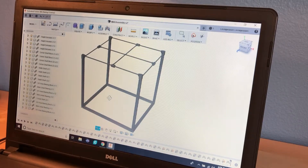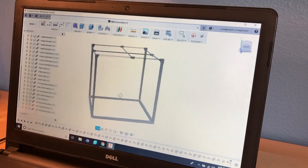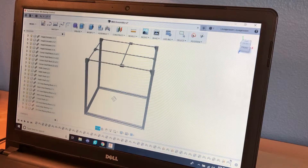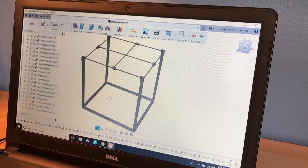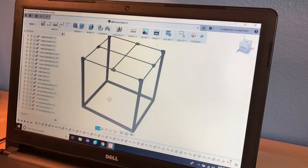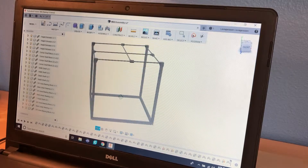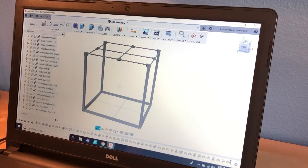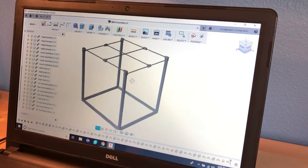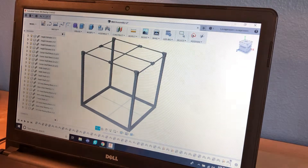Now that I'm looking at this it looks a lot bigger than I originally thought. The original intent was to build a printer with a build area of 300 millimeters cubed, but I think I might have enough frame material to make this 400 millimeters cubed — that'd be 16 by 16 by 16 inches, which is absolutely massive. I still need to add the z-axis, which will move the build plate up and down, and work on how I'm going to mount the motors on the corner.